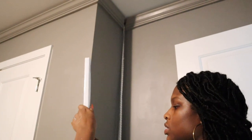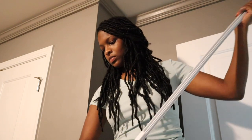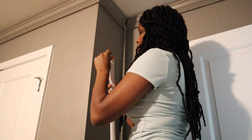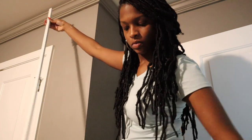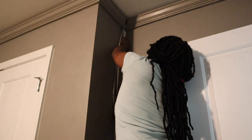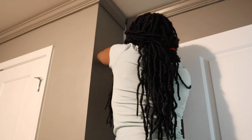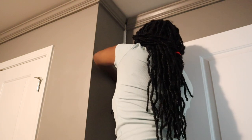Next is putting the cable covers in this corner. First, I just slid off the top part of the cable cover. Then I took off the back sticky piece because it has this double-sided tape along it. And then I just placed it directly under where the molding is and where the lighting is starting to feed out of the molding. Then I pressed it firmly into the crease of the wall. And then from there, I was able to just hide the lights and then put the cover back on. As you can see, it's scooting back up because I just slid it up, and it was so satisfying